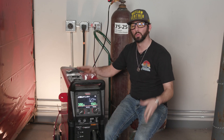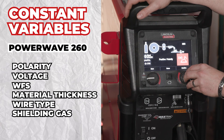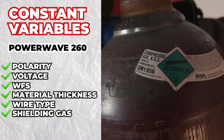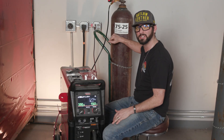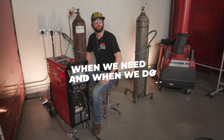What is the deal with mixed gas versus 100% argon? When can you use it for the MIG welding process? Are there other mixtures we need? We've got to do some experimenting before we start qualifying any procedures. We need a constant. We've got our basic MIG setup with the Lincoln Power Wave 260 — settings correct for material thickness, right wire, right shielding gas: 75/25 for carbon steel. The only variable we're going to change is the shielding gas.